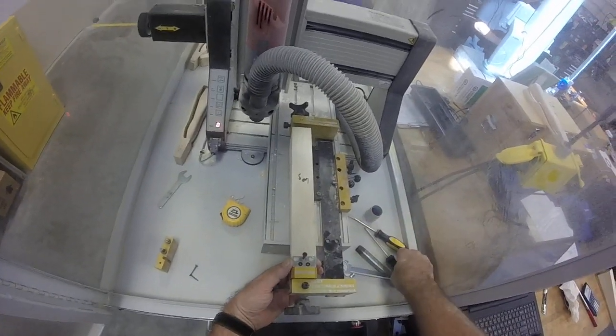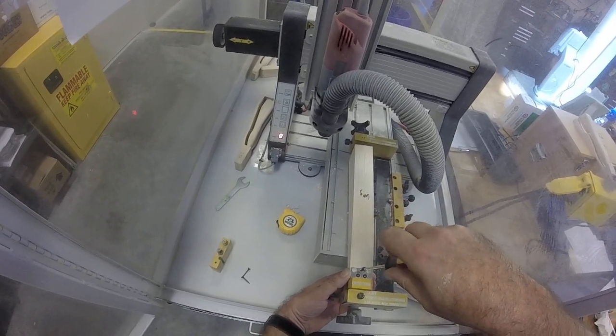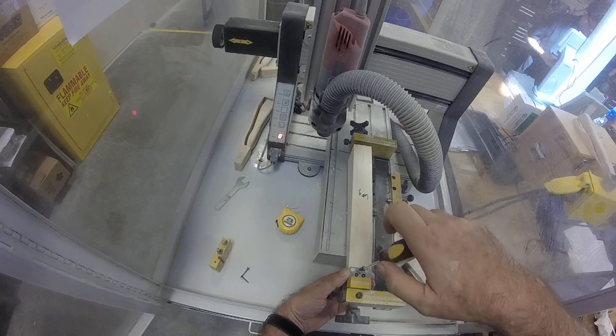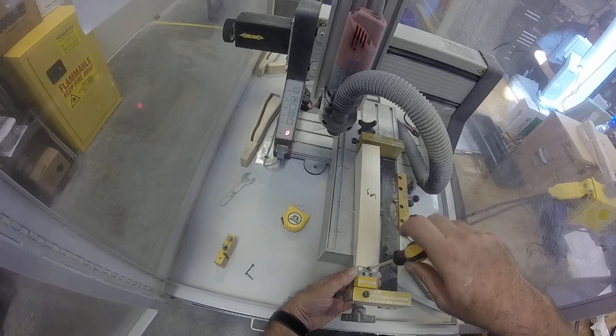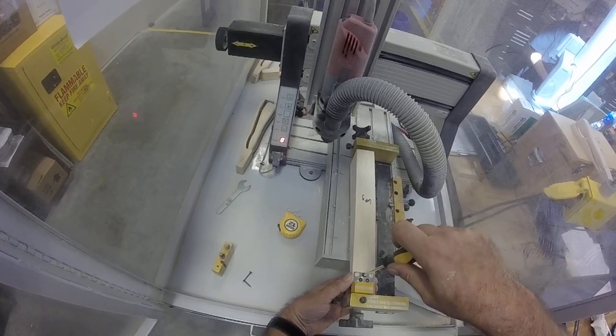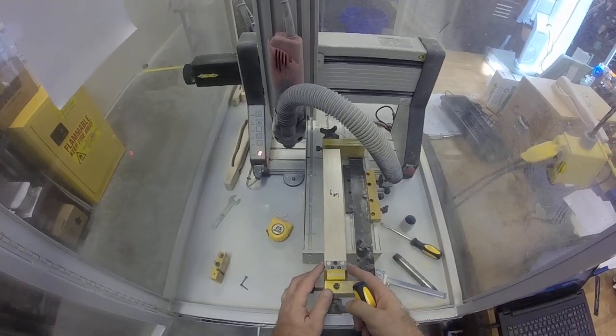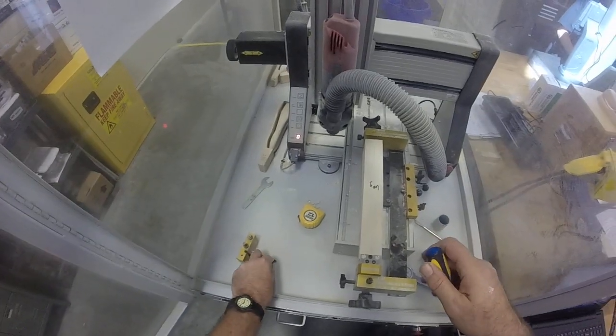This is balsa wood, very easy to screw into. I'm going to go in with flathead screws so they'll line up with the 82-degree hole that we put there on the bottom view. So now we are committed to that position. Little overhang on the left, but we have enough machining boundary in there.